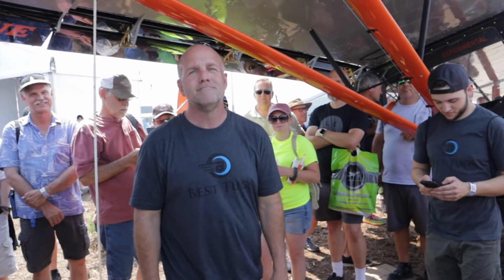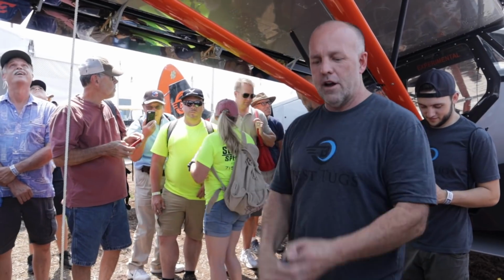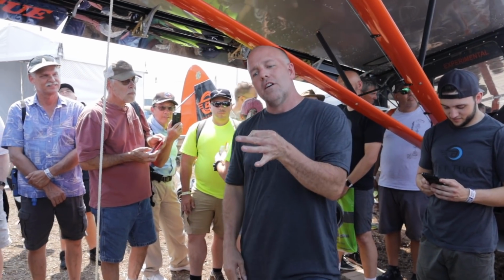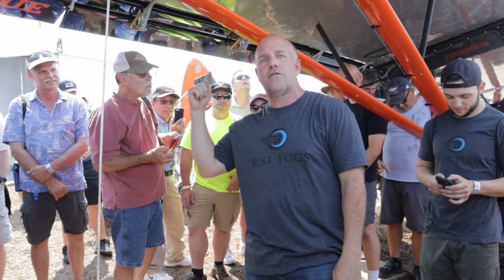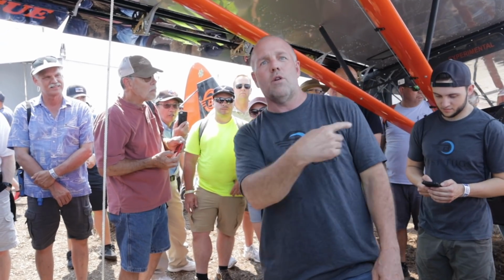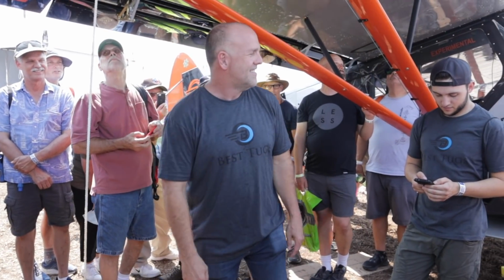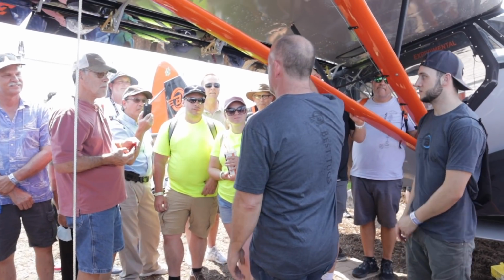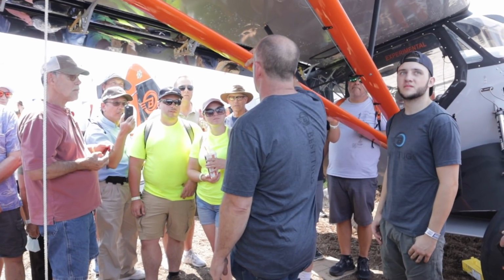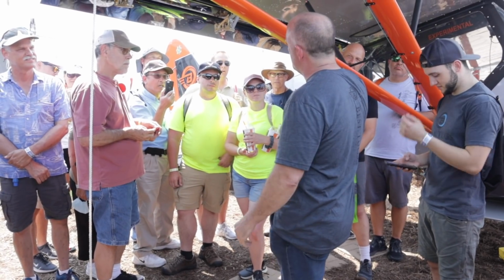So Mike, we're in the backcountry and I need fuel in my aircraft. How do we hook that up? On the bottom of the plane you see a black knob down there. I have a small line, you hook it, drop it in your wing, I flip the switch that says fuel pass, and I can send you 20 gallons and still have 6, 7 hours on board. What's my payload? Empty weight's 2,425, and I set the total load at 4,200 so far. So what, 1,700 pounds.